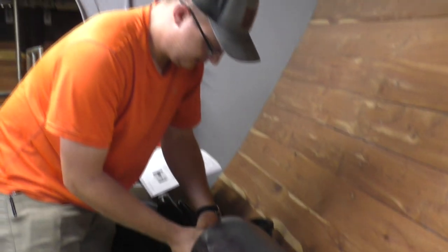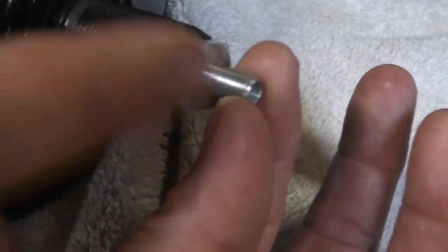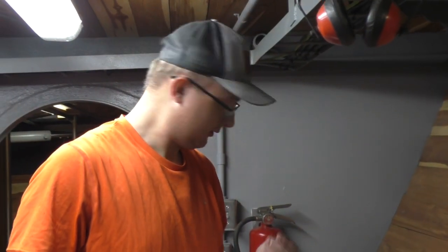Piece of wire, can we attach that to it? See, they make a little tool that threads on there, and then you put it on a wire through here and then pull it through, or a rod. What thread is that? Maybe we just make that size of a rod. This has to go through the hole, so it has to be small enough. We can use a valve stem cap like that. Throw it on there, just have something behind it. Well, we just TIG weld a rod onto that. Sure. You can weld. Yeah, make a tool.